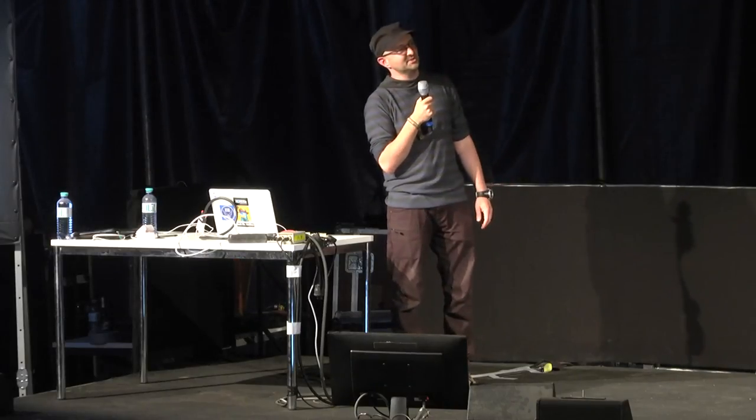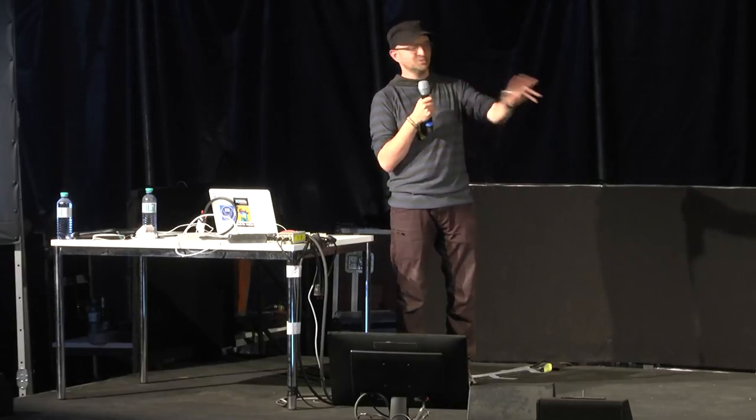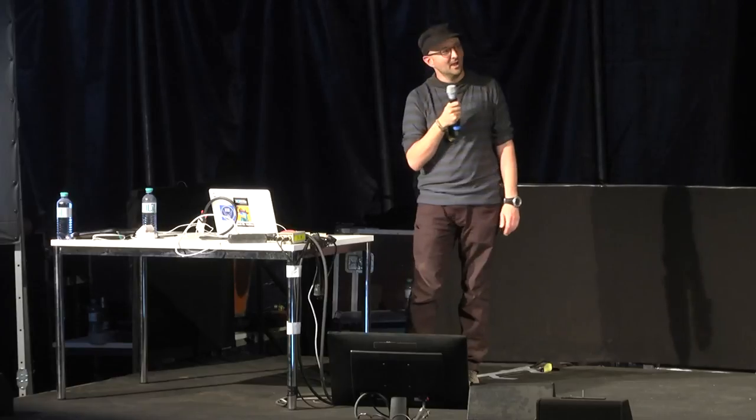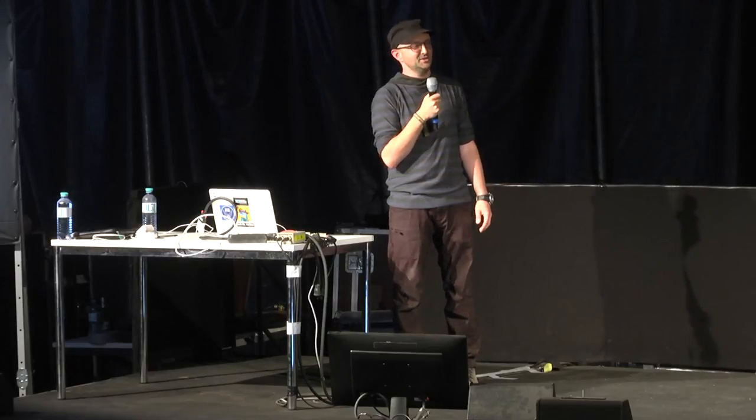So something I'm considering doing, maybe as a side project, because it's not just Ableton, it seems to be quite a common problem, is to have a MIDI rearranger box. MIDI comes in one side, and it just has one light on it, which says, there, I fixed it, comes out the other end, and things just work. But it's quite common to see on MIDI devices a panic button, and all this is just to go, something's happened, push this button, make everything stop. And for our controller, that's not good enough, so we have a system to detect when there's a hanging note and shut it down.